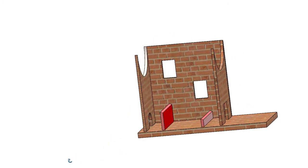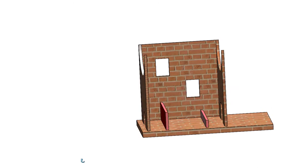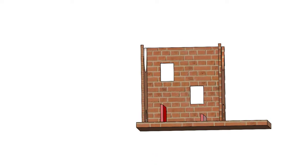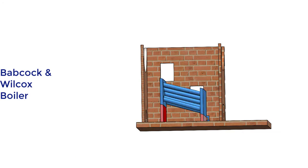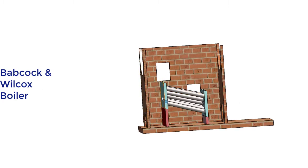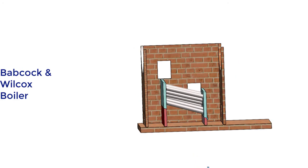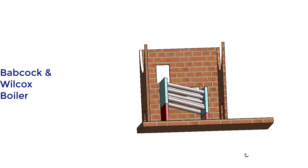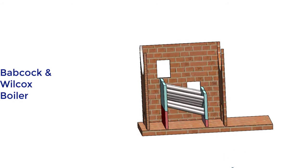These are the walls at the other side of the boiler, and these two pillars support the water tubes and also the uptake and downtake headers. There are two headers — the left header is the uptake header and the right one is the downtake header. Both headers are connected by some water tubes, so water may flow from the downtake header to the uptake header.